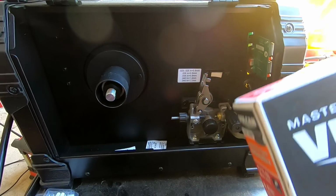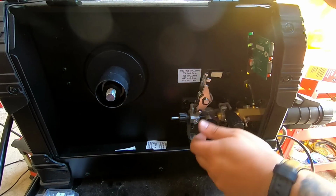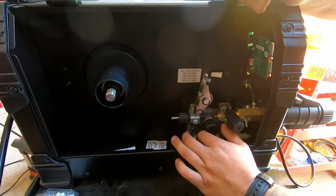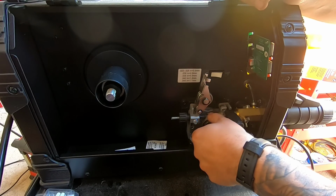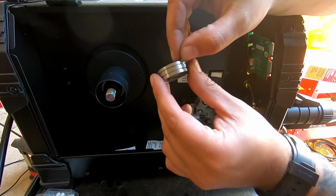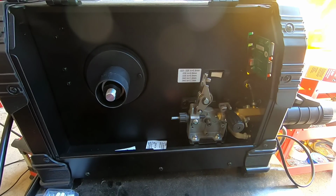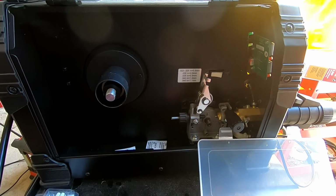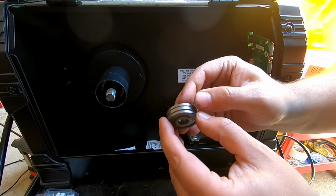All right, I got .030 flux core from Harbor Freight. Anyone else? Flux core wire is like crazy expensive. I don't know why. But on the Primeweld here, all we got to do is change the roller out. This is a MIG roller. It's got the smooth, GoPro won't pick this up, but smooth rollers, and the flux core ones have grooves, or they're like serrated almost.